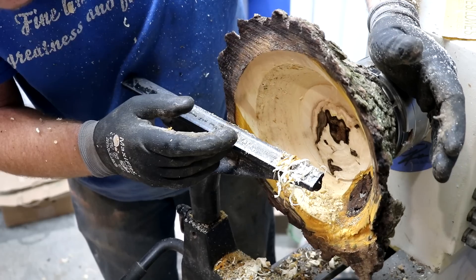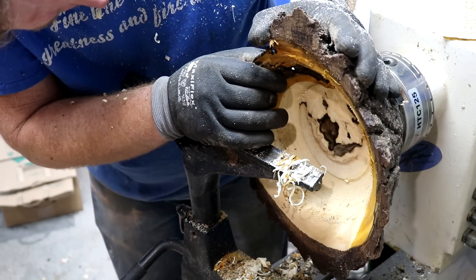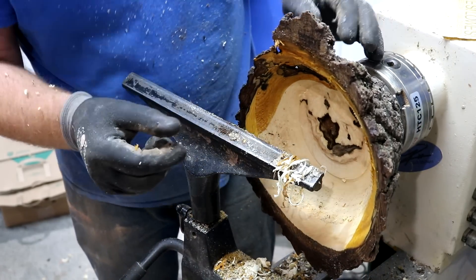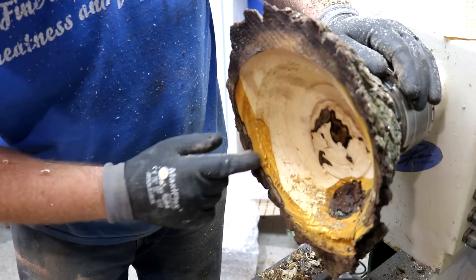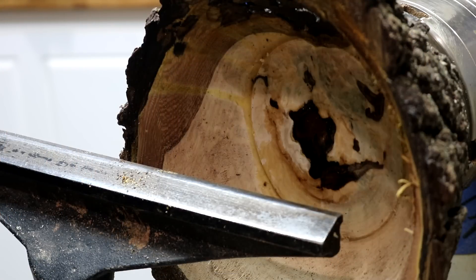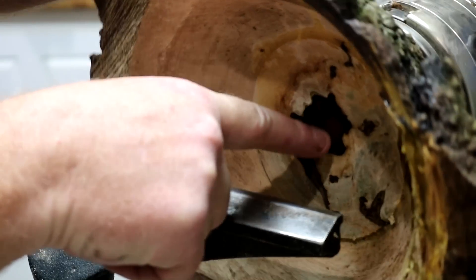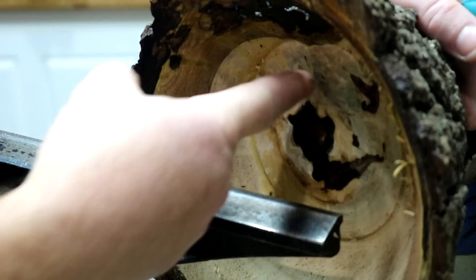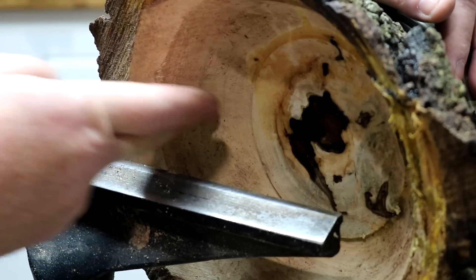Little figure here — super sketchy. I mean really, that's just being held on by that much. The bottom looks really cool though — it all looks really neat. It's been a day or two and I've soaked the rot with CA glue. This real thin spot too with the CA — I don't want to go too far down because I don't think this is going to continue dark, so I'm just going to clean that and scrape this.